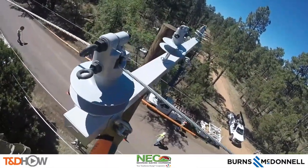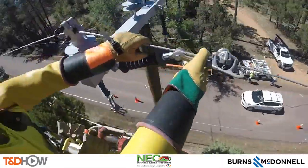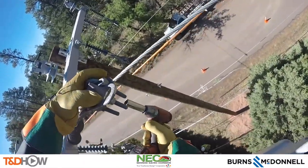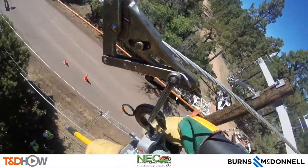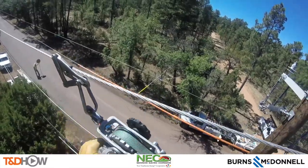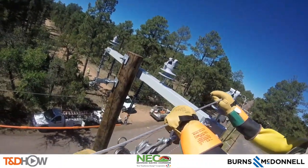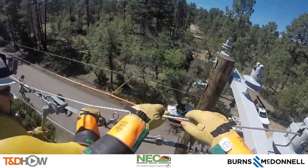Next, on this side of the cross arm he's going to install a dead end. And if you heard that as he connects with the line, you can hear that it is a live electric line. Now he's going to tighten down the shoe on the end of this dead end. On the other side of the cross arm he's going to install a clamp — also sometimes called a pork chop due to its shape — and he's also going to use a series of straps and a winch, also called a come-along, to tighten this line and create a bubble over the top that they call a jumper over the top of this cross arm. You can clearly see that bubble or jumper being formed here.